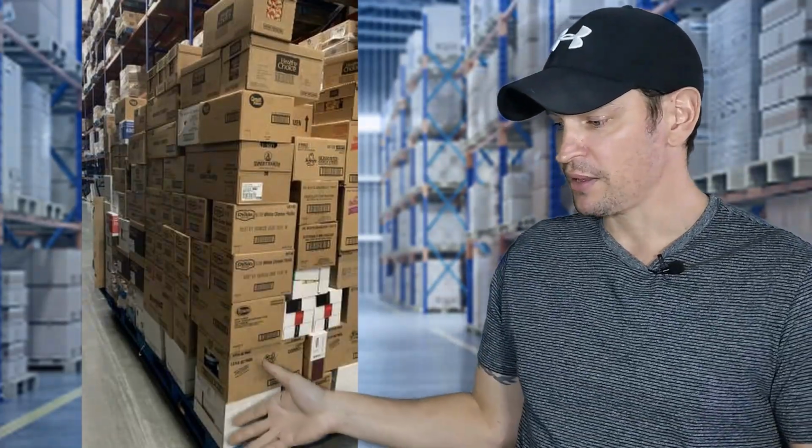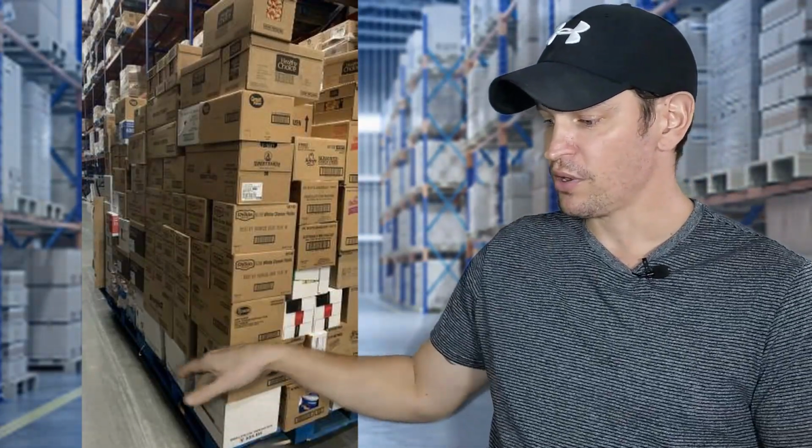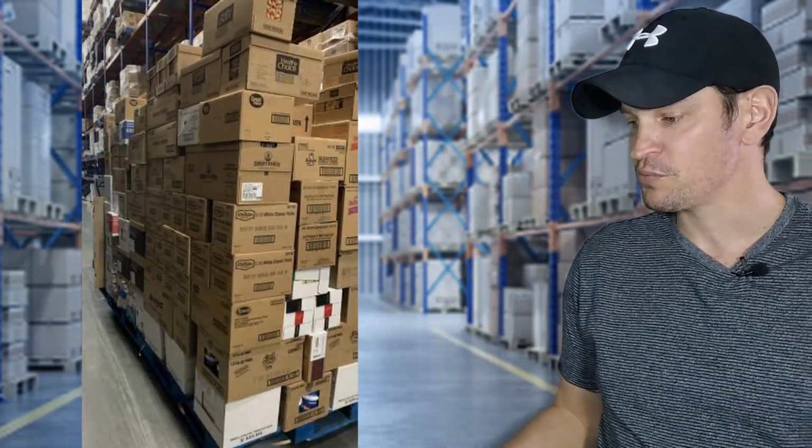All these pallets I showed you today were in the perimeter of the pallet. Nice square pallets in the perimeter, like this one. Nice spaced out, and then they kept it nice and solid. All those little white cases in the middle that are smaller. Even though this is column stack, they have a couple of cases here and there, just off-centered on the gaps a little bit, just enough to tie it in.